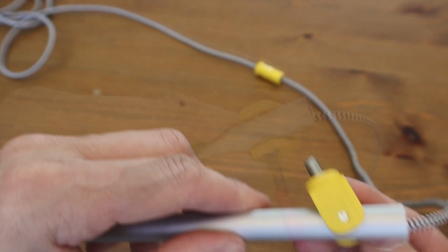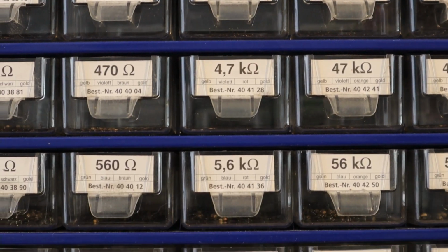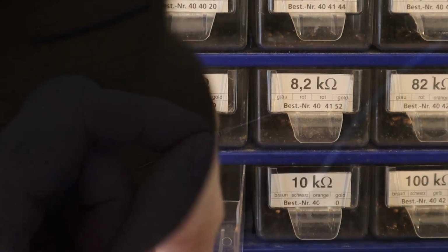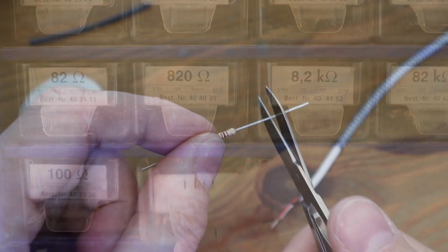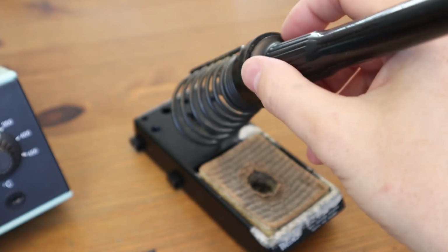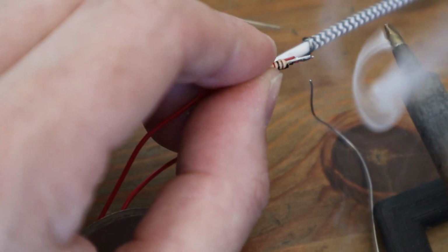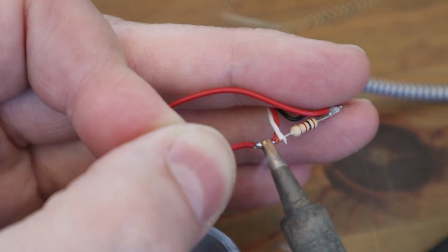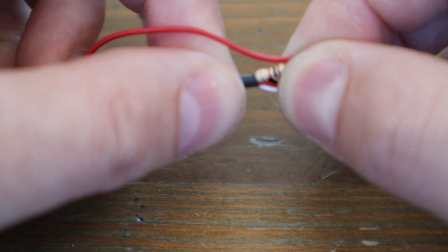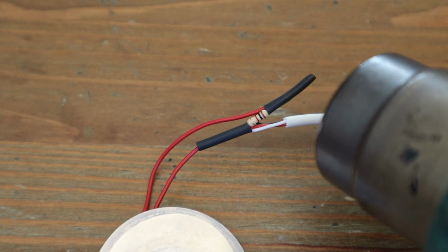When using the piezo element as a membrane in a reproducer, it generates enough energy to be directly fed into the line input of any modern recording device. This makes the entire setup very practical because no batteries or amplifiers are required. Actually, the piezo element generates too much energy, making it much too loud. And its output impedance is way too high to meet the line-in standards. Both these problems can be easily solved by adding a shunt resistor.